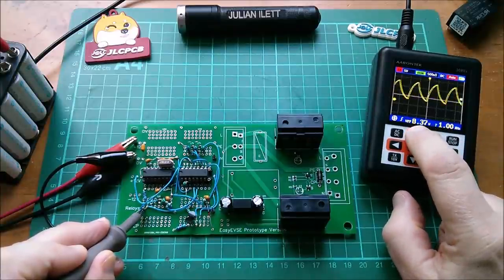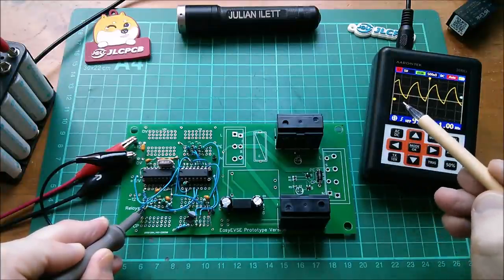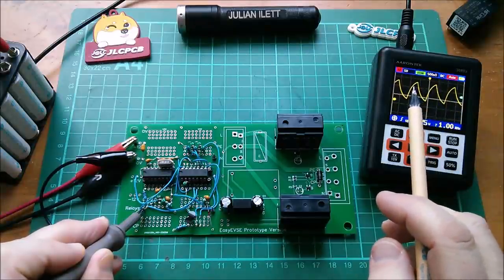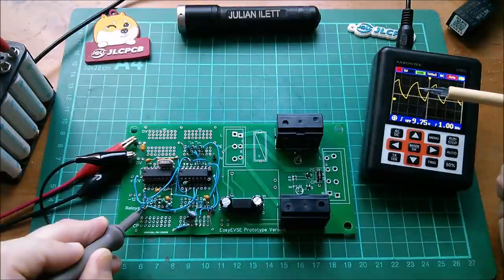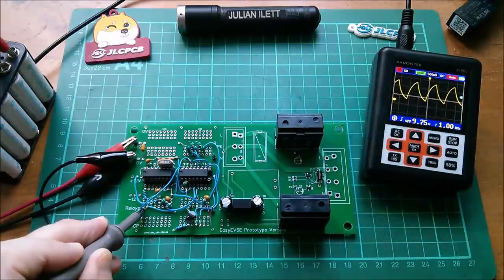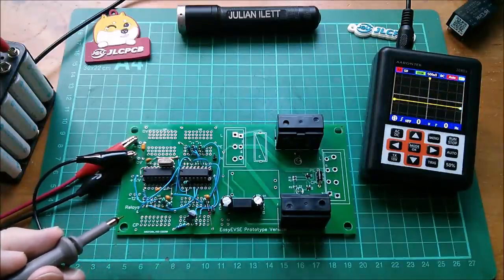Let's look at the top end of that cap. Now we can see a triangle wave — it's not a precise triangle wave, it has a capacitor-style rise and fall. But the point is if you put that into a comparator against a fixed voltage and move that voltage up and down, you will widen and narrow the resulting pulse. Let's take a look at the output of the first comparator.